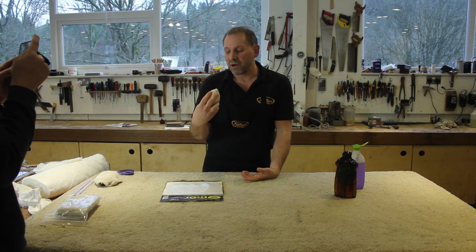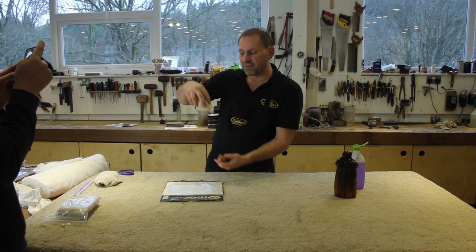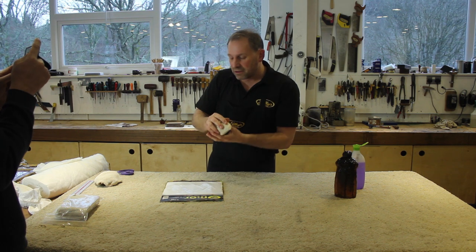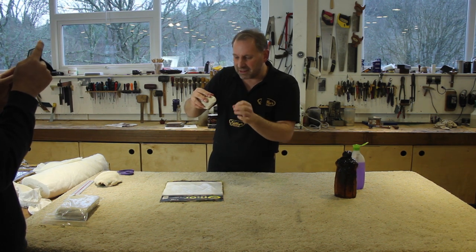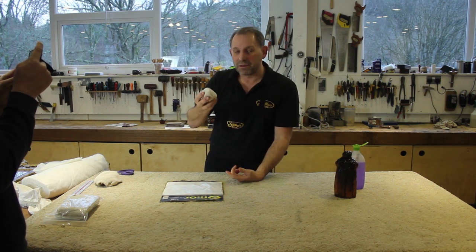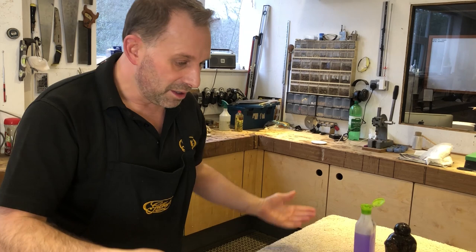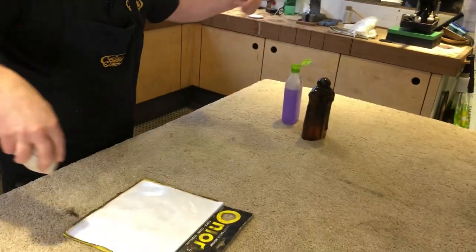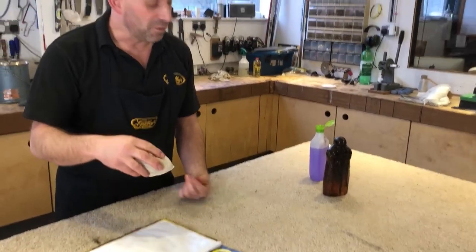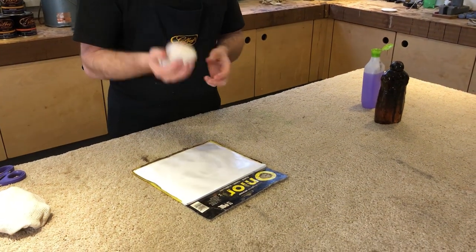A few more times and we'll have a perfect rubber ready to go and start French polishing. That is the correct way to hold it in your hand — I'm not squeezing it. This is the reserve of French polish, it's like a reservoir of French polish and methylated spirits. This is what comes out — not one of those little silly small things you see everyone else using and pouring on the table. It comes from the rubber. There's enough polish in here probably to do a table almost the size of this bench, at least to get it up to a stage before we need to recharge it again. Hopefully that gives you the idea of how to make a French polish rubber.